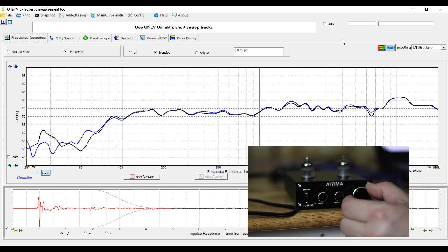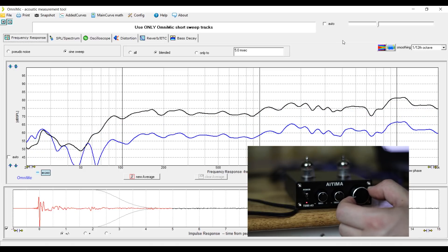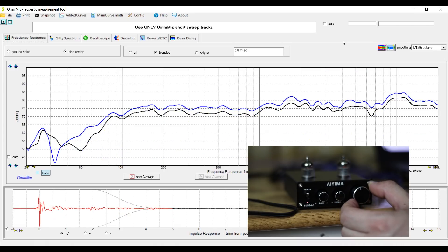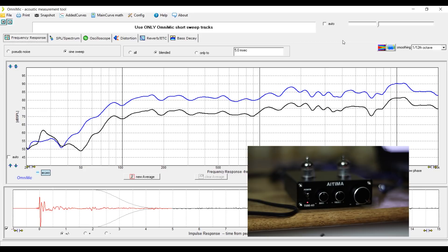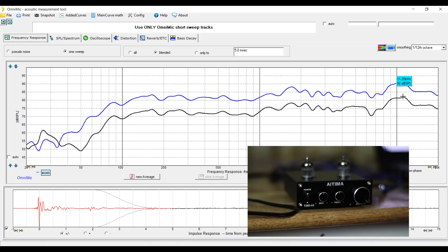What's neat is that the frequency response of the speaker hasn't really changed — that's pretty good. We want to see minimal change in the actual frequency response. We also notice pretty decent volume attenuation when turning it down, and we can get it all the way down to zero with absolutely no sound from the speaker. Now turning the volume all the way up, notice how quickly it rises — we're measuring with SPL. Turning it all the way up, it gets to be 10 decibels louder. That's a pretty good increase, and I was impressed with how much the volume can be boosted. So if you have an amplifier that's not quite as loud as you'd like, this tube preamp would be beneficial.